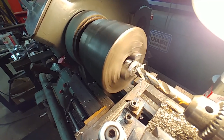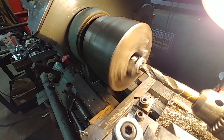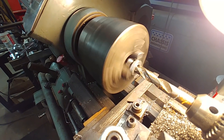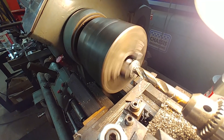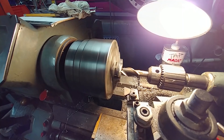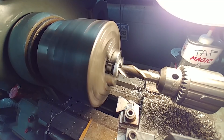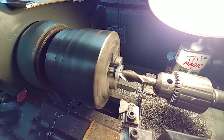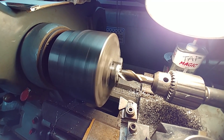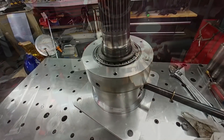At the same time the o-ring will keep the whole tube centered in this nut, but allow a little bit of flexibility so the oil collar can ride on the prop shaft with a little bit of movement. I drilled it out and now Brit set up a larger bit and we're just doing the recess for the o-ring.